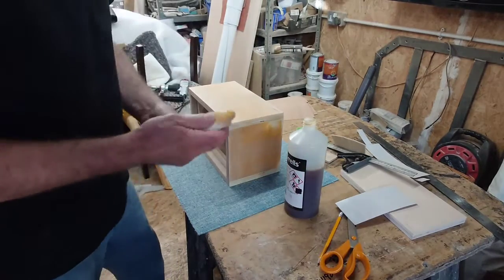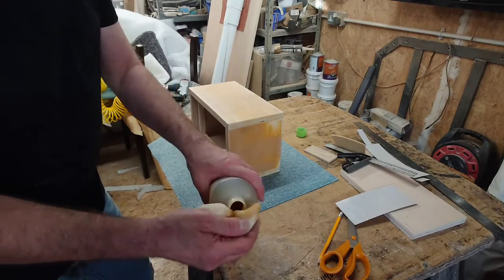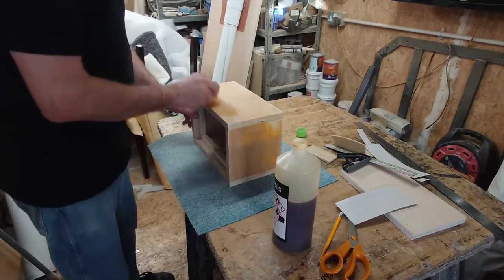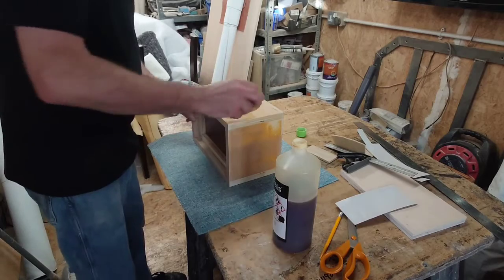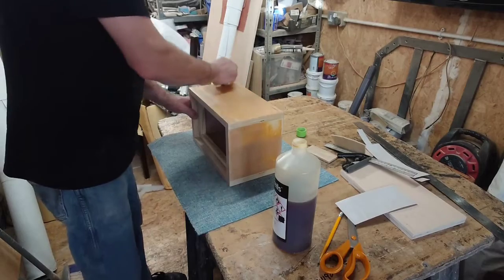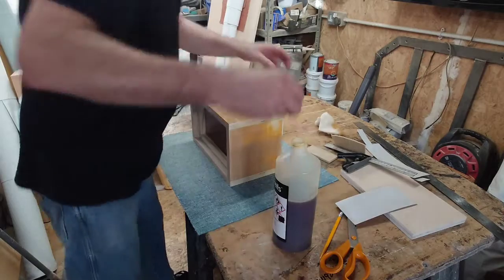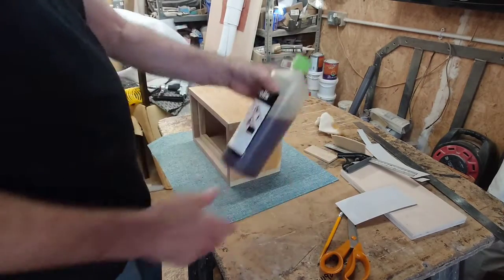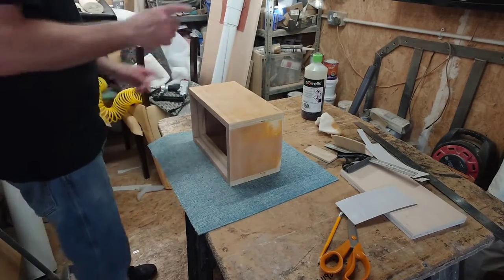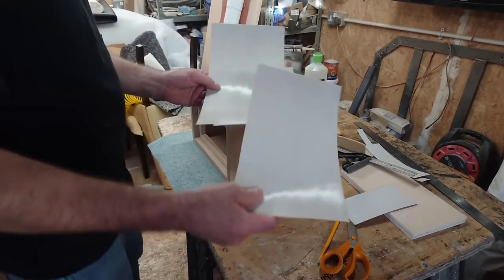Because this is not wood glue that's on the back of that, it's some sort of contact adhesive, and contact adhesive won't absorb into the grain of wood. There's the veneer gone on the floor there. Effectively, if it's a dry surface on there, it's not going to stick to it as well. So you could put another layer of contact adhesive underneath it, but if you do what I've done here, you could put a coat of any varnish, or water-based varnish, but it's better with this. This is good stuff.